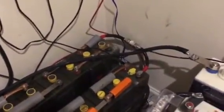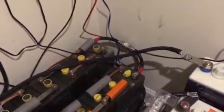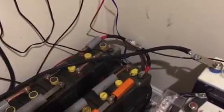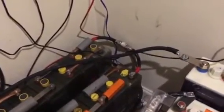Essentially, I had them in series, 4 cells in series, and I charged them at a constant rate of just above 30 amps for 4 days straight, non-stop. The only thing the cells experienced was water loss, which was expected and acceptable. So I kept the batteries watered and just kept the charge on them, and that appears to have done them some good. Woke them up and made them ready for continued service.